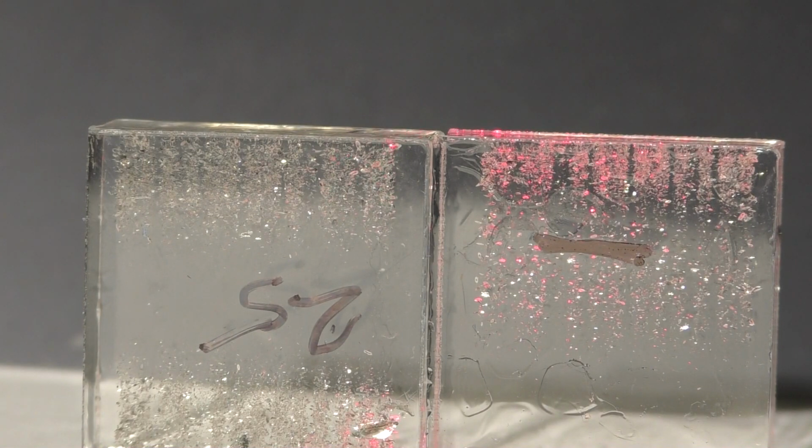It hasn't really proved the point about the wave theory idea of superposition and the addition or the extra power. For a material that shouldn't mark, we've been able to mark it. We've been able to create a problem inside there, and we've got control of it. Now, whether this is interference caused by colliding light waves adding together to increase the power at specific spots, and of course it will be totally random because every pulse will be different, which is why we've got a range there. In fact, we've got two ranges, one above and one below the focal point.